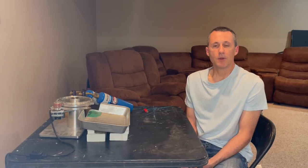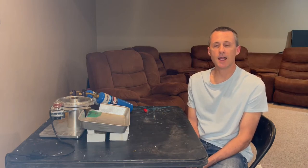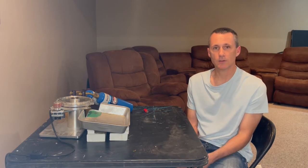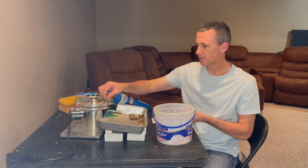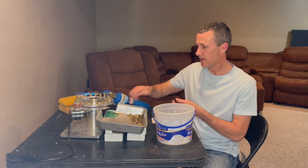All the previous steps have been about cleaning and organization, and honestly they don't have a whole lot to do with precision and accuracy. That is not the case with this next step. Step four: annealing. I'm going to explain the basics of annealing without getting into the heavy science. To make it simple — constant movement of the brass work-hardens it. Work-hardened brass does not move like new brass. When we anneal, we're realigning the molecules so that the brass can move like it should. I use a Ken Light annealer for all my annealing. Once I get it set up, it's pretty quick — as fast as I can stick them in the wheel, they're getting done, and it's very uniform.